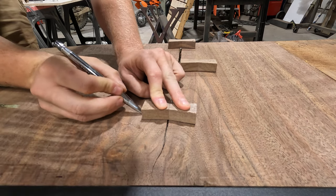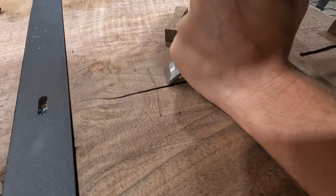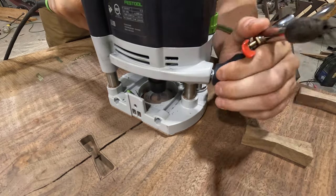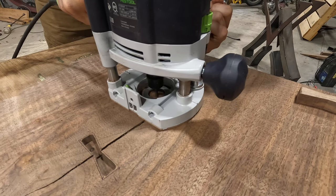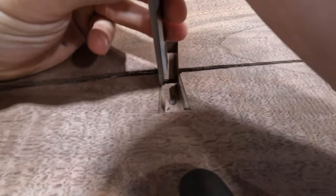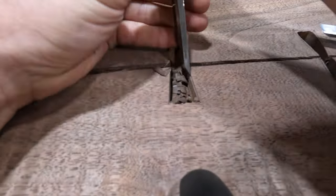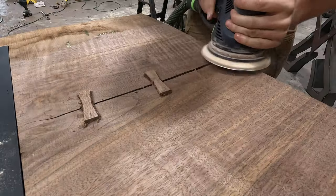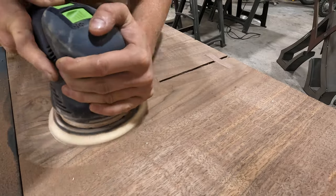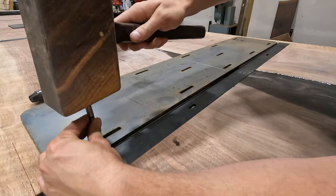On one end of the table right in the center, we had a decent-sized crack. The interior designer and I decided we didn't want to fill it with epoxy, so on the bottom side I put in three bow ties to help it from ever trying to open up. I personally am a big fan of leaving cracks natural if I can — I just love that rustic vibe. This crack is big enough that it'd be pretty easy to blow something out if you really needed to. If you haven't had a chance, try to find one of these Rotex sanders and do a demo — the amount of material they can remove is absolutely impressive, and it's the best way for me to knock those bow ties down.